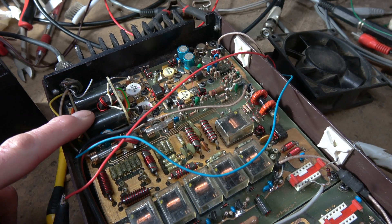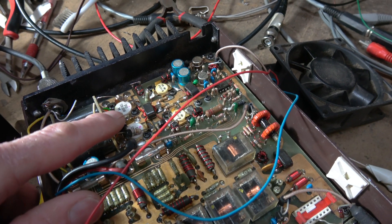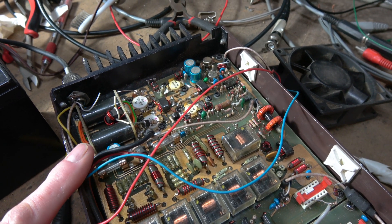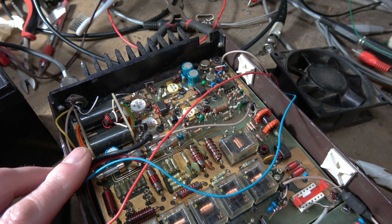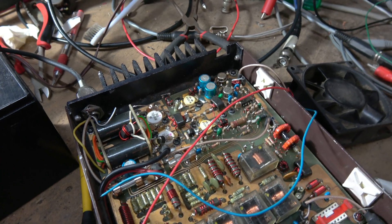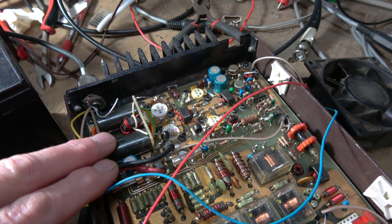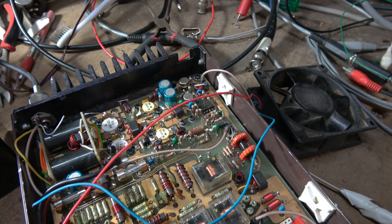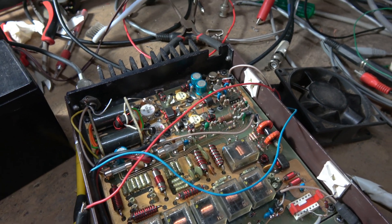We have the unit here. It's got two MRF421s — they're quite high power transistors, I think 12 amps each or something. They don't seem to pop. I think they're running pretty close to burnout the way I'm using them here, but you can push them. I think they're being pushed into Class C to shove a lot of RF into the thing.